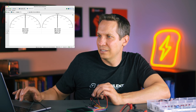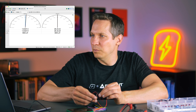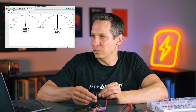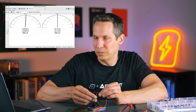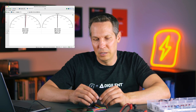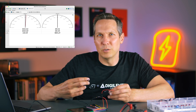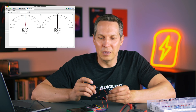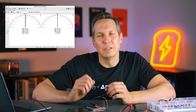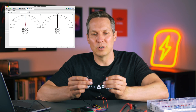As I do this, you'll notice that nothing is happening because I haven't actually turned on the voltmeter. So I go over here and we're just going to do run and update every one second. Now I put these against it — perfect — we're reading about 1.03 volts, which is about what you would expect. Now the interesting thing is, when I take this part out it's saying 30 to 35 millivolts. This is where you have to have a good understanding of what's going on, because you might look at that and think, okay, let me put down 34 millivolts. But that doesn't make any sense. When you see these numbers, you have to have that intuitive understanding — I don't want to do 35 millivolts, that's not even close. That's just basically stray voltages that these are picking up.